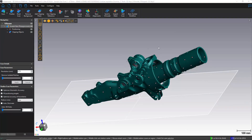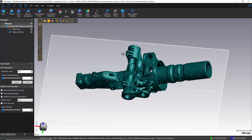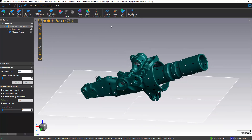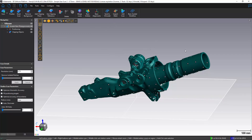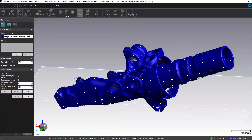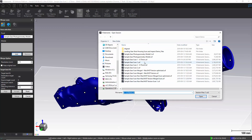You can see here that I've flipped the part, re-scanned, and then used the background removal to get rid of the table again. In this particular case I did the scan in a separate session — we do support multiple scans inside a single session, but this is a way to keep the file size a little bit smaller. So I'm going to use our merge scans function and add it from an external session.